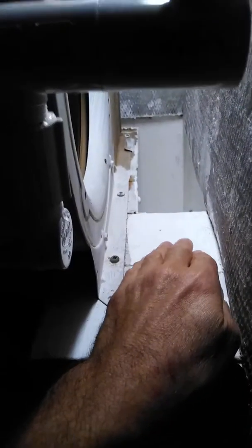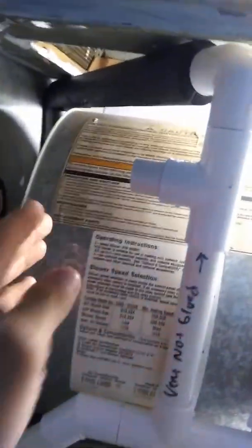This is after I had fixed the condensation line. The pan's not sitting flat on the flashing anyway because they didn't install it right. So what happened is air was getting through, but air would have got through anyway — it's not an airtight seal plastic on a metal piece of trim. So air was getting through and that was causing the condensation. The only thing I have left, which there's not much I can do, is the coil dripping because it's not flowing right. So every now and then you get a little drop of water. It comes down and gets on here. But it's pretty minor.